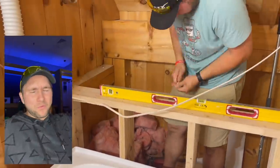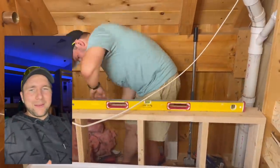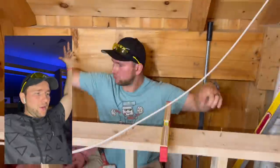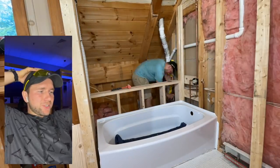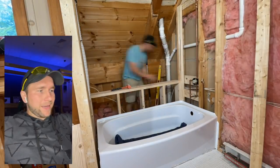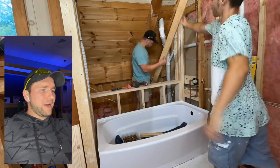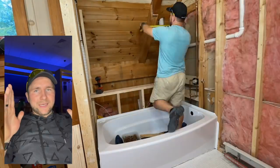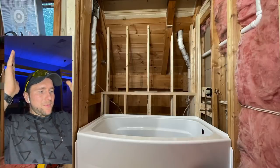You could do that with your waterproofing, but it's a little more pain to do it that way. So we got that done. Next, we're just basically filling in the framing. There's a couple of framing pieces I have to fill in near the valve — I did my two outside studs, got those up, and then did the middle.